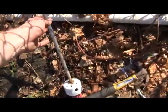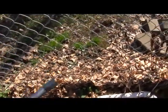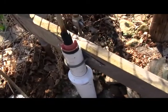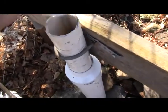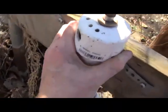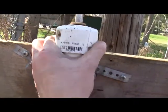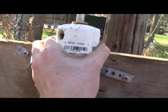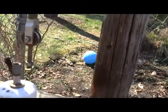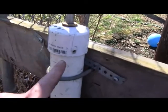The next step: we're going to take our piston and get the cap to go all the way. The cap is captured in there by the coupling nut so it doesn't come off — this is all one unit. We'll stick that in there. If you listen carefully, you might hear the water that's already in there. For this system, I want to get these holes lined up because that's how I reprime the pump. You can see I've got a little screw hole here.